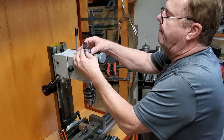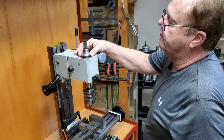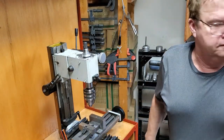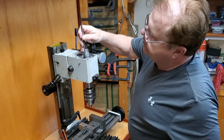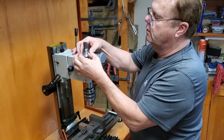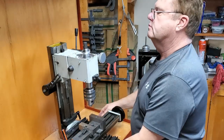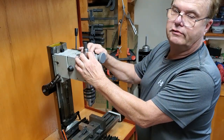Install this spacer. You want it loose enough that you can slide it up and down, because you may have to lift it back out at some point. If it's too tight, file it. Align the keyway — it shouldn't need much. Sometimes you just have to turn it over the other way.